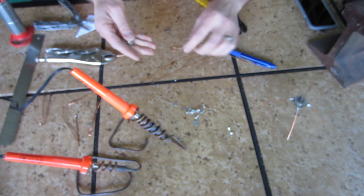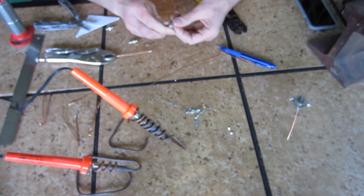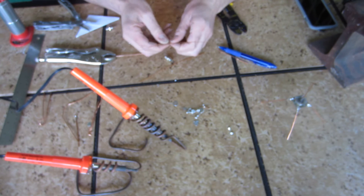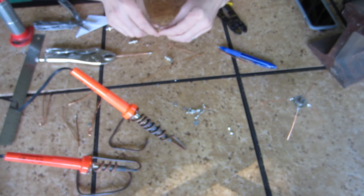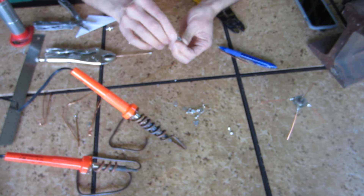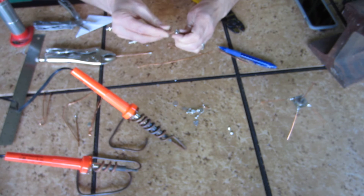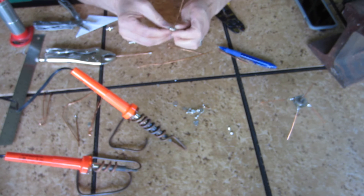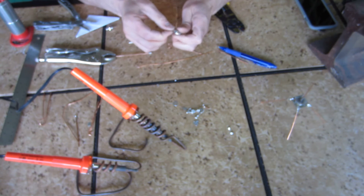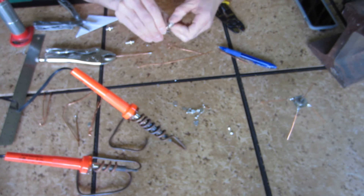I'm going to take three pieces that are about 180 millimeters long, giving me six radials. What I'm going to do is take each one and bend it around here, then secure it with one of the F connector lug nuts. Start by taking one of the 180 millimeter pieces and bending it roughly in half. From there it's pretty simple to continue bending them around because this wire is very flexible. Get it all the way around — you can also do a little twist in it if you want. Then move on to the next one. Make sure you get close to being halfway bent so you'll have enough for the full 68 millimeter radial.